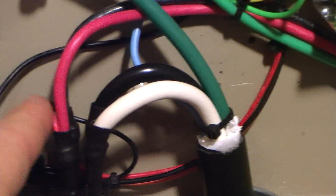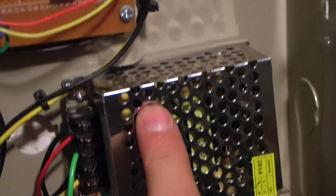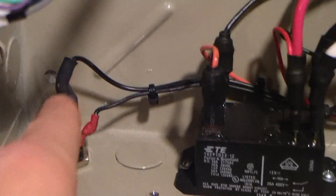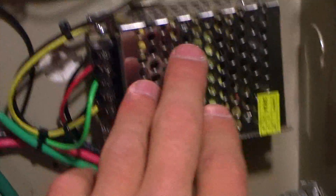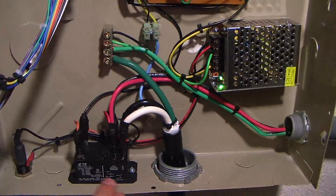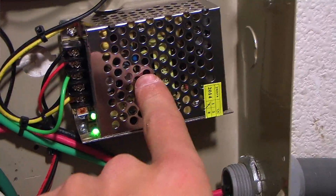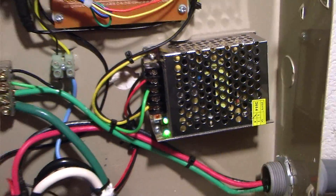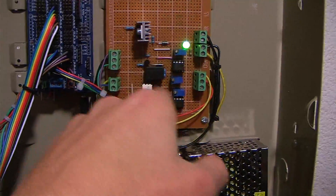There are also small wires that come out of the input power. One hot phase goes directly into a component here, and the other hot phase goes into a fuse holder — about a 1-amp fuse — which loops back in. This is a 12-volt power supply that puts out all the low-voltage power needed to run all of our control circuitry, and also drives the power relay. It's a 100-240V input supply putting out 12V at 2 amps, and even with the relay on it draws less than an amp.